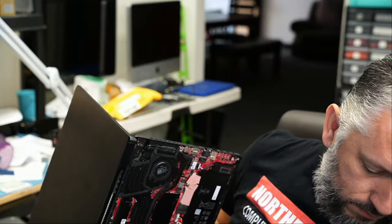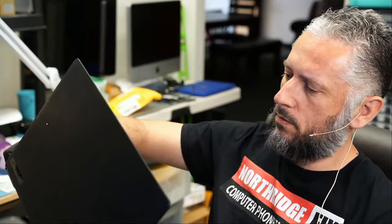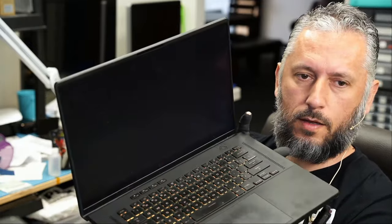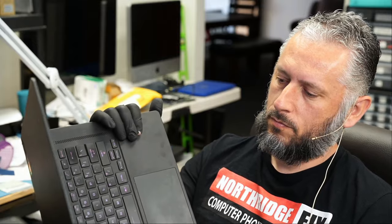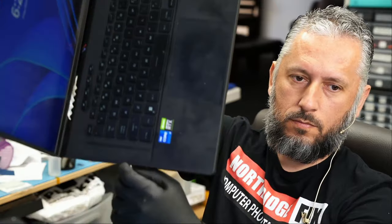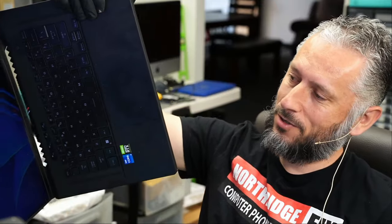Big Bus just reassembled the fans and heatsink. Let's plug the charging cable and hold the power button. It's gonna power up with the keyboard backlight, but we want to see something on the screen. Yes! Wow, we did it! I want to wait about 30 seconds to a minute, then disconnect the cable to see if the battery is taking a charge. Yes — done! The battery was empty but it did take a charge, and we're done.